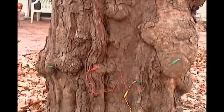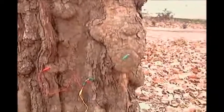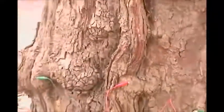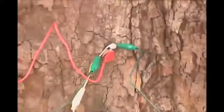So this is our setup here. We've got four nails in the tree. Let's zoom in on one. Each nail brings up the amperage that's going out of the tree. It doesn't increase the voltage. The voltage more or less stays the same regardless of how many taps you have. And it doesn't seem to be too critical as to how high you have them up, but the higher you have them up, it seems the less potential you have. This seems to be in the nominal area.